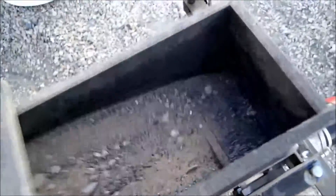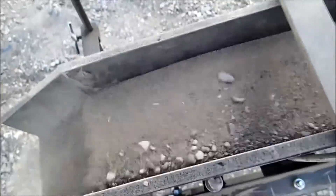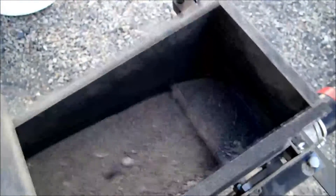There's one of the baffles starting to show up. I've got six separate cells in here that are an inch deep, and the discharge is about a half or five-eighths of an inch above them. So we've got about an inch and five-eighths of total depth on the material. You can see there isn't much material going out of that last or first cell right now.